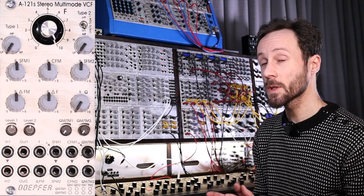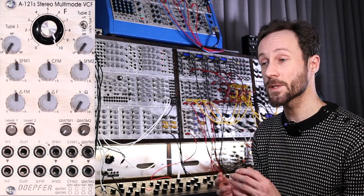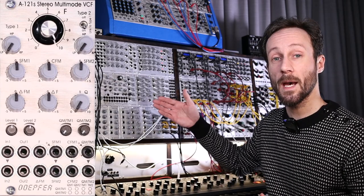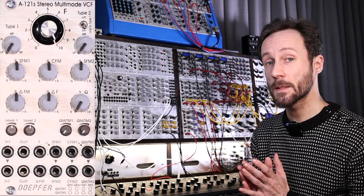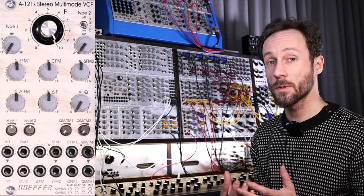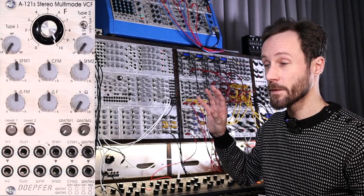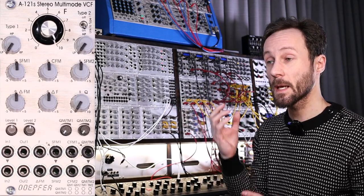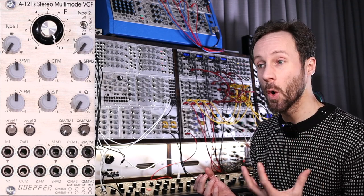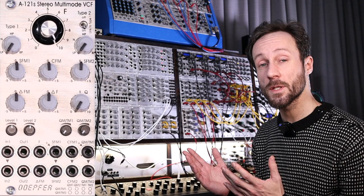It is a module that is very easy to put a few control voltages in, and they are normalized to the second filter, and this normalization is broken when you add a control voltage. I think it's a really pretty compact module that features two really nice filters. The sound of the filter, I think it's creamy, and in low pass mode, the really low bass, it still keeps it when you add some resonance.